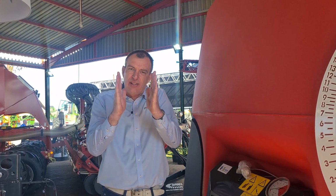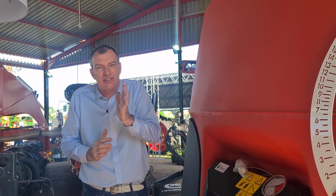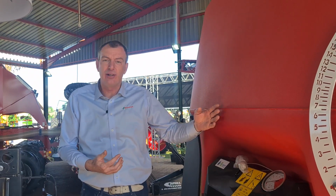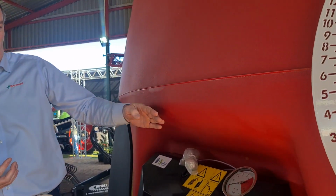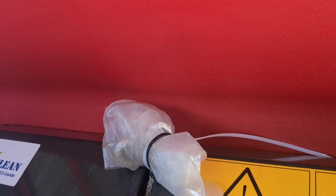And there are tractors where there's really 20 centimeters that I can't even come in between to couple it. Because the closer it is to the tractor, the less the backward weight on the tractor. That's the big advantage. You see also the tank here, it really comes over the frame, and every centimeter that you come closer to the tractor saves weight and is better for your combination.